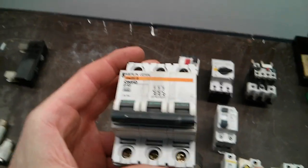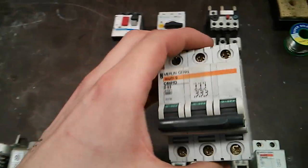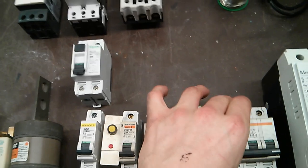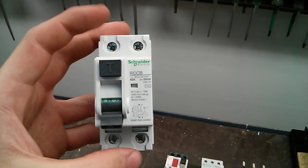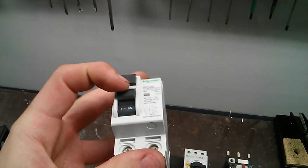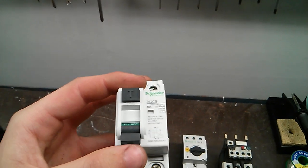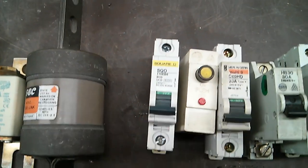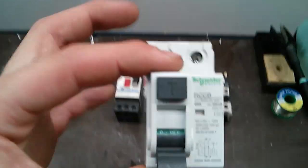Type C is what they call motor rated. Type B is for inductive loads, slight small ballasts and things. Type A — you don't usually see those these days — they're just too sensitive for most things. We've also got an RCD, or RCCB — they're practically the same thing and behave in the same way, just with a slightly different name. You also get RCBOs, which look a lot more like an MCB but also have a built-in RCD — so it does both. Best of both worlds really.